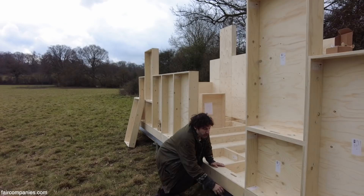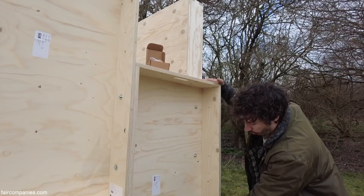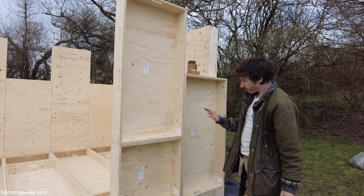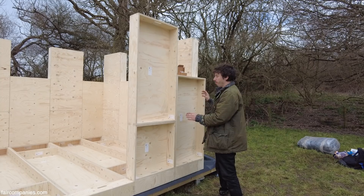You can see that at the corners there's a slightly different situation. Because we're connecting between one wall and another, some of these boxes have little holes in the face. That just shows us it's a corner. We've also got this signature pattern — a brick bond effect. The reason we're doing that is that when wind blows on the side of the building, this box here strengthens the joint between those two boxes, making it a really strong system.